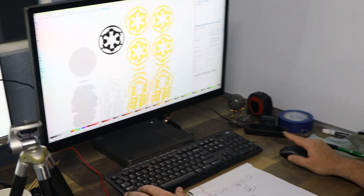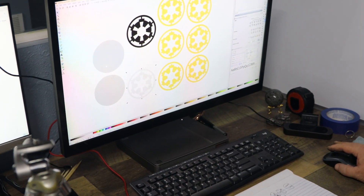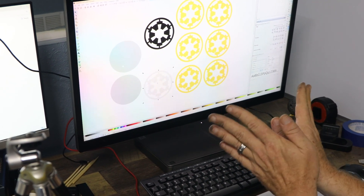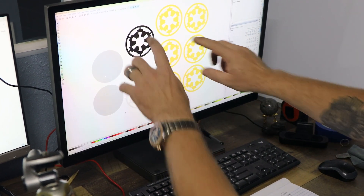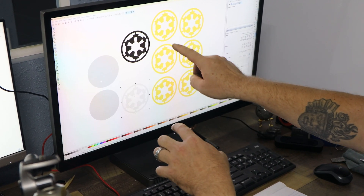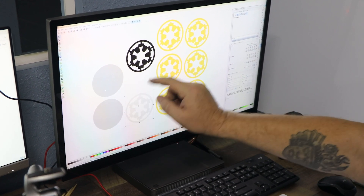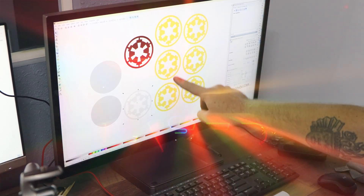That's why I color-code my stuff. This is going to be a clear acrylic layer that's going to go towards the bottom. What this will do is allow the light to go on the outside of the design and then light up the wall on the outside too. So this is clear acrylic, this is mirror, this is black acrylic, and those are my wood layers.